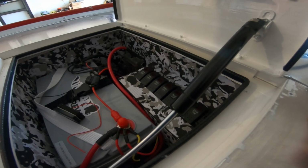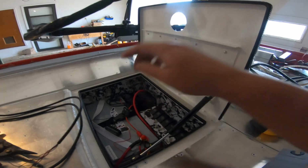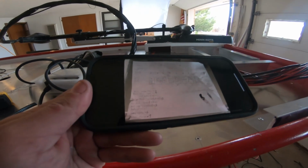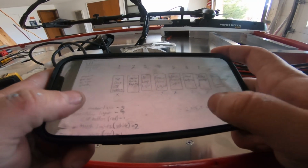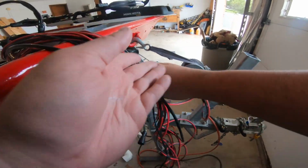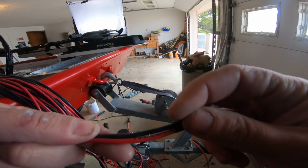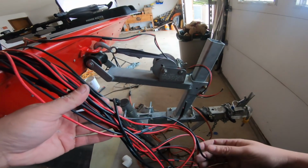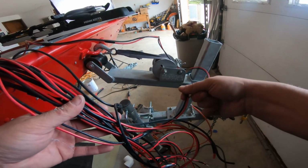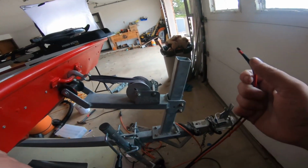cockpit lights, running lights, cabin lights, deck light. So deck light, number 1 switch. Here is my paperwork with all the info on it. Top deck is number 1. And again, all these wires are marked. Every wire has a series of dots. So that wire has 7. So we need to find the one with 1 dot. There she is. So this will run the top lights.